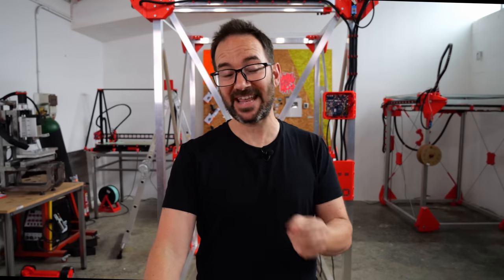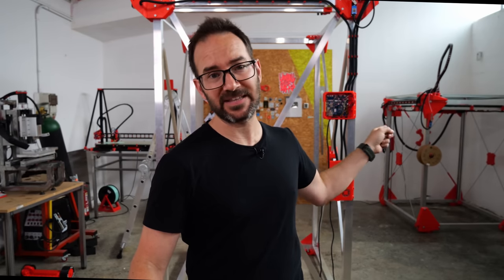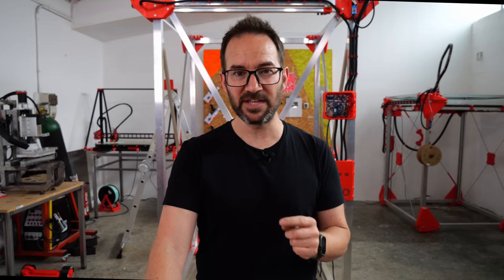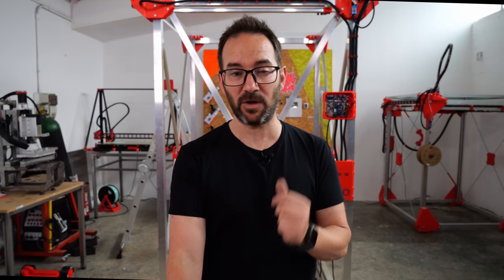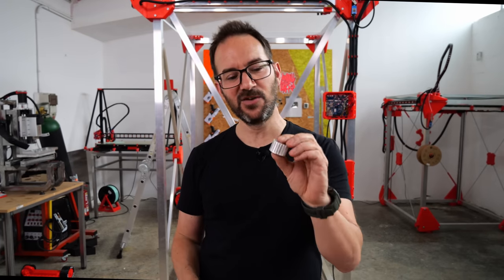You may have noticed that I'm missing the pulleys on the motors, and that's just because I wanted to try some pulleys bigger than the ones on that printer in there, because I wanted to see if I can move the bed up and down a little bit faster. But I couldn't find pulleys of the exact teeth number that I wanted, so I used my DIY milling machine to make new ones.